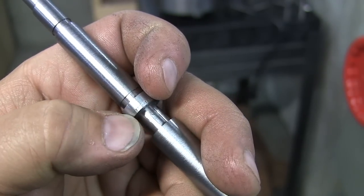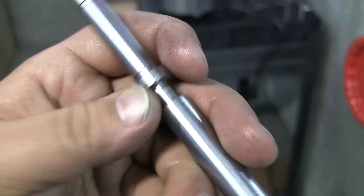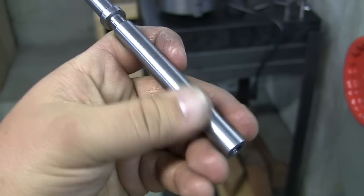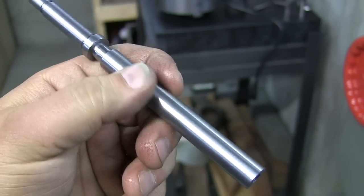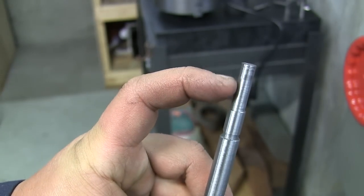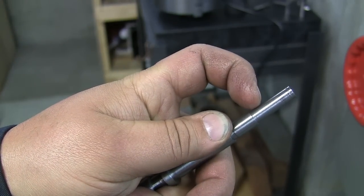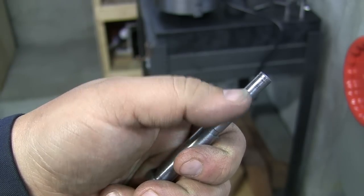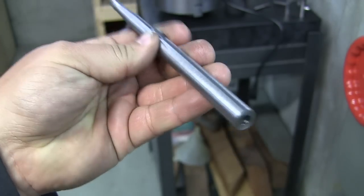Over here you could see, I don't know if you could see this because of the focusing, some chatter all along the side here, and that's really from trying to get a tool in there. The back of the tool rubbed it accidentally. But this Acme surface is dead on. We're at 497.5. It might fluctuate by 0.5 thousandth a little bit, but we're dead on. We have a lot of extra room here to saw off. Most of this will get parted off, and maybe about 3/8 or so will be threads right here, and the ball crank will be right on here. So it's coming along.